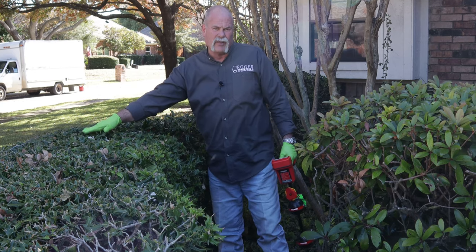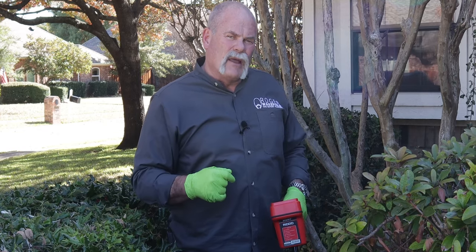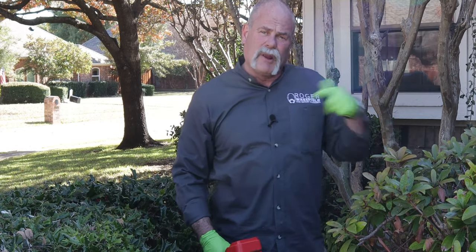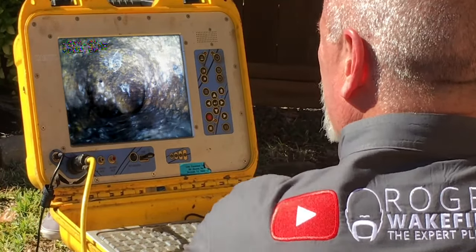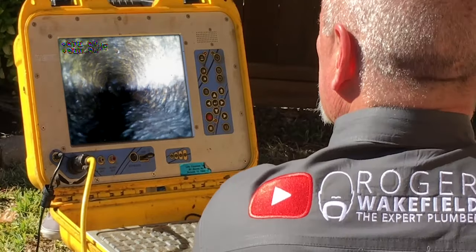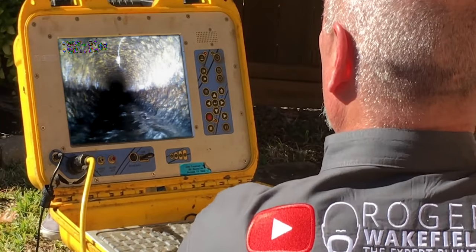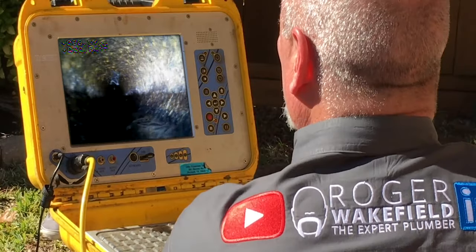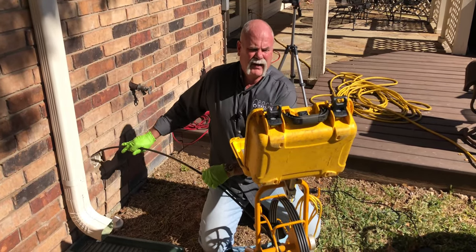The head of our camera is right out here under the bushes. I'm going to pull the camera back about 10 feet, then come out and locate it again to determine which direction the sewer runs toward the front of the house. We know we're about 10 or 12 feet too far out, so I'm pulling back slowly, looking along the top for any clean outs. There appears to be something on top of the pipe, possibly a clean out — I'll pause it and go locate again.